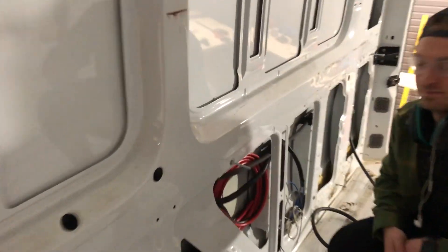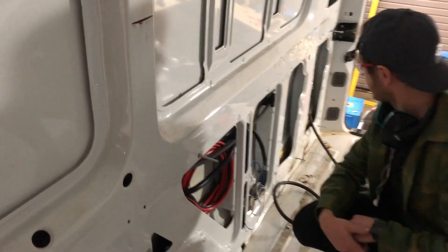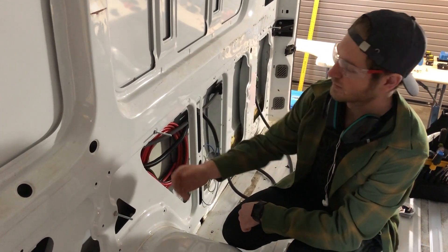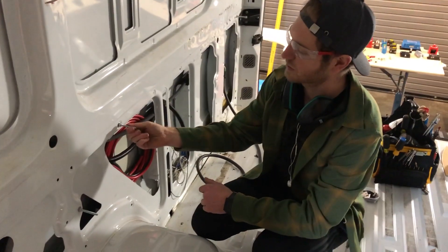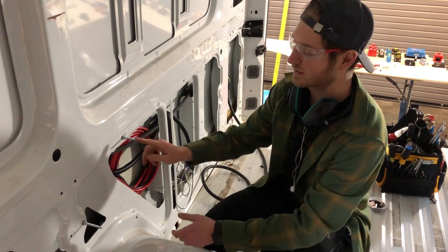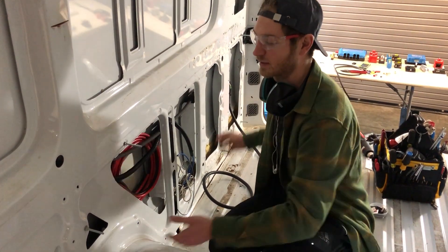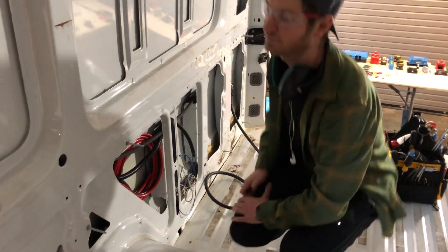John, tell me about these studs that you've installed. We have four of them — basically these are the load-bearing studs that will hold our board with all the components on it. The factory has these pre-drilled holes, so we put a stainless steel bolt through and tighten a nut on with a lock washer so it can't go anywhere. We're going to put the board on here, give it a couple of hits right where the studs are, and it'll make an impression on the backside. Then we take the board, drill those impressions out, and when we come back to mount the whole thing, we'll be able to slide it up on top of the studs. It's much better than self-tappers and can hold a lot more weight.